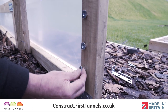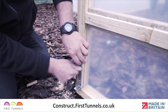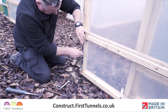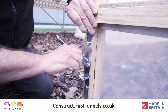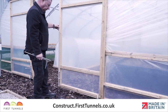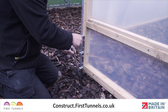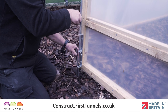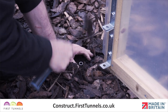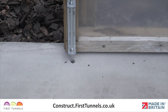On the inside face of the door, insert pronged T-nuts into each hole. Bolt the two angled brackets onto the door with the slot on each bracket at the top. Open the door and position it to the required position. Slide the drop spike down through both brackets and mark the position on the ground. Open the door and bury the tube in the required position. If your polytunnel is on a hard base, the housing tube is not required — simply drill a hole using a 9mm drill bit to an appropriate depth. Repeat this process on both doors.